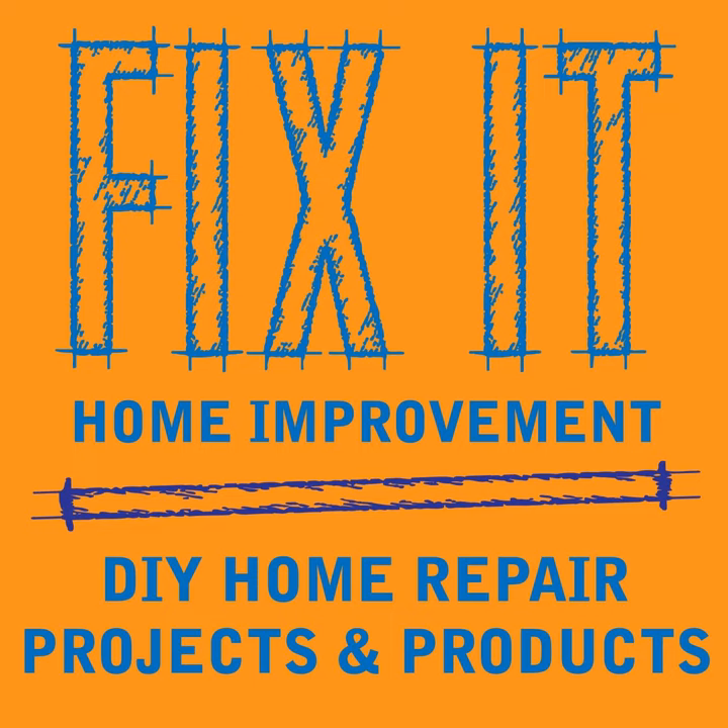Bathworks doesn't recommend using a bath mat after refinishing a tub — they say it will eventually cut through the finish of any bathtub coating. They have a kit with a textured additive for a non-slip surface, and recommend that if you want to use a bath mat, use one without suction cups and remove it after each use. They recommend a paint respirator and good ventilation. Their premium refinishing kit comes with a two-part coating, primer, cleaner, a tack cloth, gloves, a mixing container, a paint tray, roller cover and handle, a foam brush, 120-grit sandpaper, a non-slip additive, and a sponge roller. They recommend purchasing their Easy Etch Kit for cast iron, steel, and ceramic tubs to degloss the surface. The liquid products are flammable, so keep away from flames or sparks.